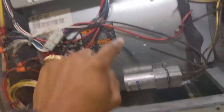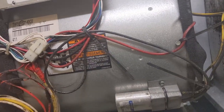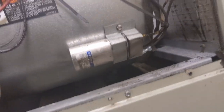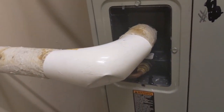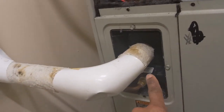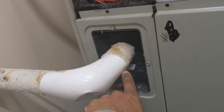I'm going to turn it on. I can hear the thermostat trying to do its thing and I can hear the freon going. What's happening right now is because the fan is not kicking on and freon is flowing to this line right here. Because the fan is not kicking on, the whole system is iced up. I can hear the freon but I don't hear the fan.